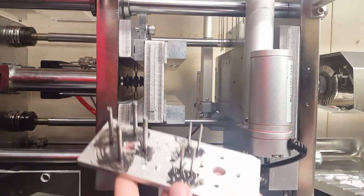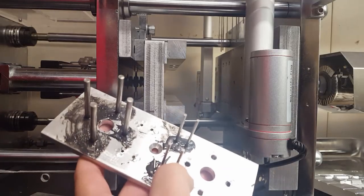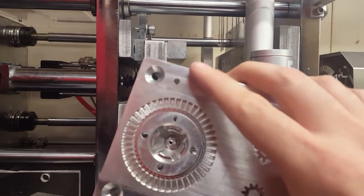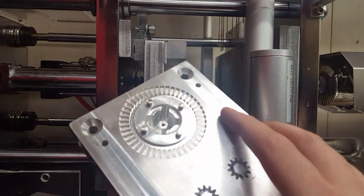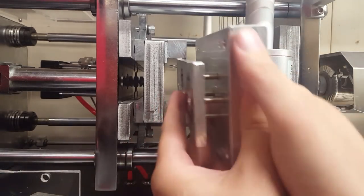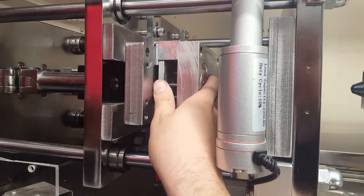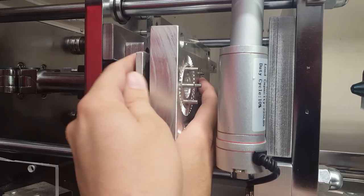And then here's another one of the pin plates. This one I had some difficulties with the pins sliding on me, so I tried to use some JB Weld to lock them in place. Seems to have worked, I think. And these ones actually used some larger pins just to push that gear out, because that pocket was so deep in there. And this, you can actually see easier, that the pins go flush with the surface when it's in here. You can see that they're flush because the plate's back against that wall there. And then when that pin in the middle comes to eject them, it would come out like that and push the part out of the mold.